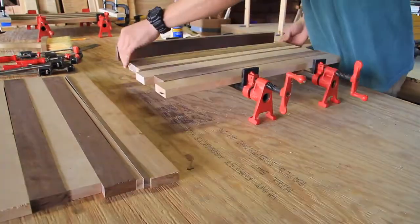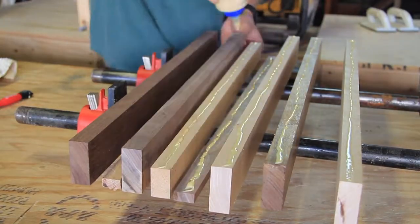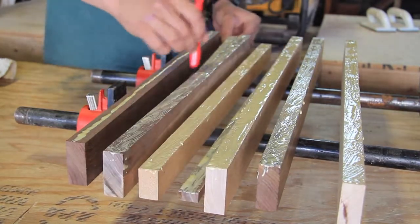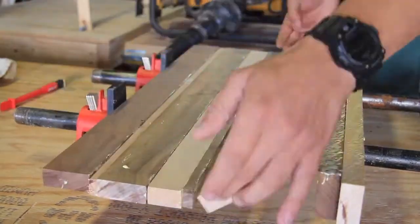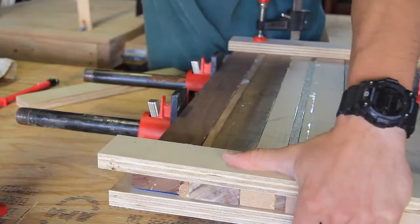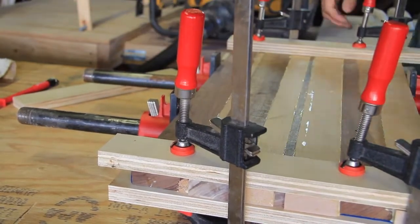It's kind of funny, I always tend to use either too much glue or too little glue when I'm doing projects like this. It's kind of difficult to find that sweet spot when it comes to the glue. But I will say that if you're doing a cutting board like this, it's better to overuse glue than underuse, because you'll be utilizing this with water on the board. It might be moving around constantly, going into storage and out of storage, onto your countertop. So overuse glue if you have to.